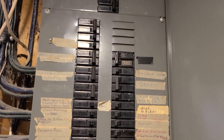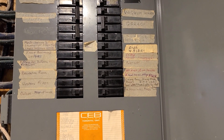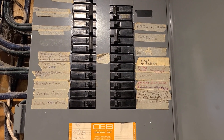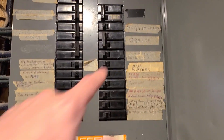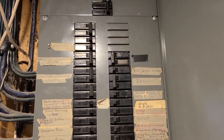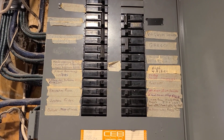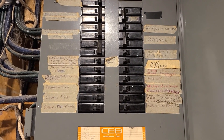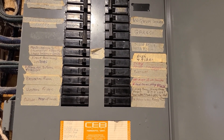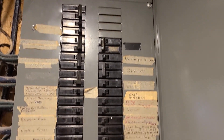That's what I am doing to split my power on my rigs — hope this helps somebody. Let me know if you've got more questions. I am NOT an electrician, so do your own research and due diligence. If you're doing anything crazy, like putting breakers in, call an electrician — don't play with live wires. Anytime I put breakers in I shut off the main power and disconnect it from the house so there's zero power going in. Electricity is serious business — don't get yourself killed over it. If you're doing anything more than just little home mining, do it the right way. Hope somebody gets something out of this — let me know in the comments, I'll talk to you guys later.